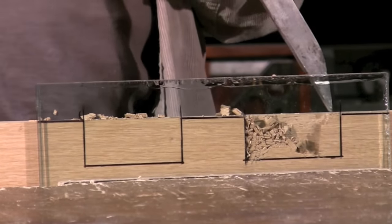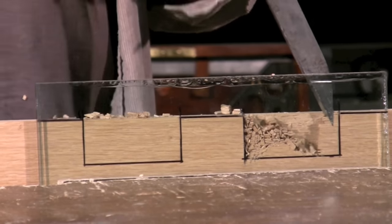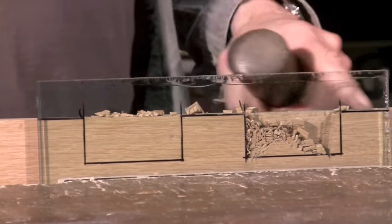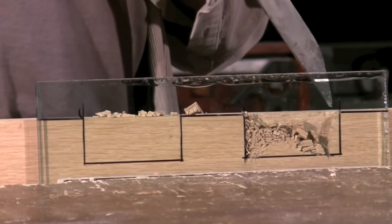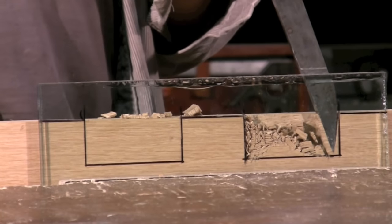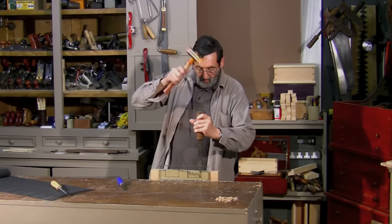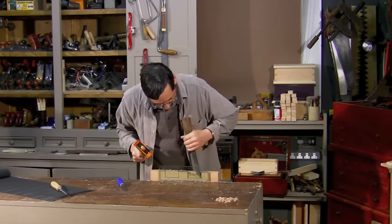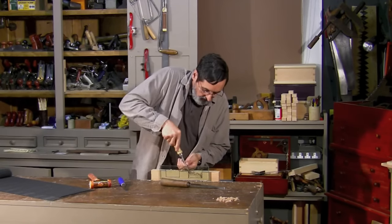I'm getting close to this edge. I don't want to lever on that top rim — it's not good practice. I can lever still since I have three-sixteenths of an inch there. I'm going to go right in on this edge now, lever away, and then go perpendicular with the flat face. So I'm just down to my line there, and then I'm going to use a thinner chisel just to clean out that waste wood.